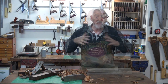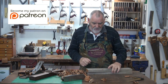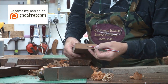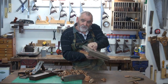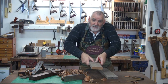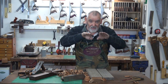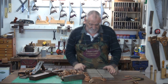If I'm joining a lot of boards together for a tabletop or something wide, I will have the growth rings on the tree alternate. So this one would be running down and this one running up — you turn them around. That way when this one tends to want to cup, it's got one either side that wants to cup the other way. It lends stability and allows the table to stay fairly stable. Whereas if you had them all going the same way, there's greater stress and you can split timber or pull screws out. So that's how we'll join this piece.